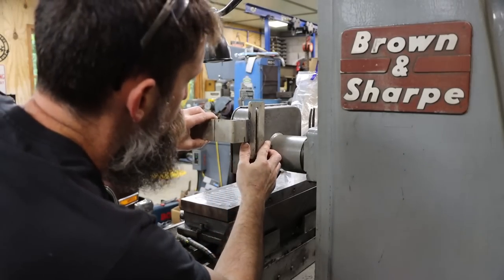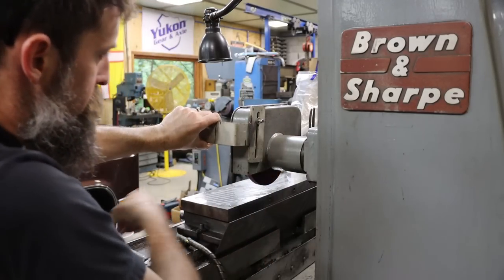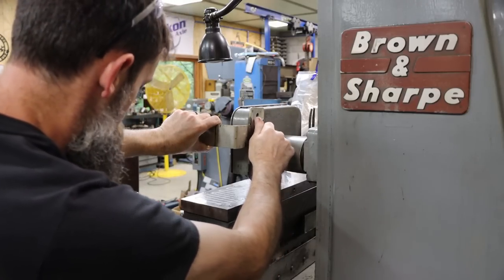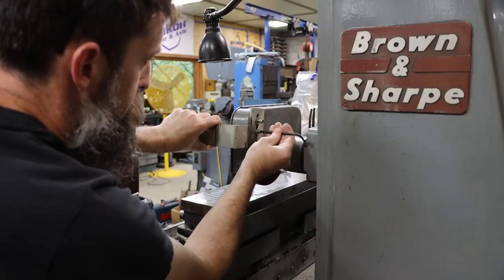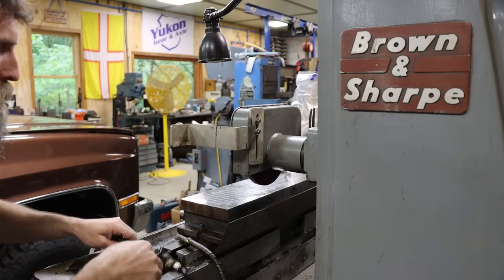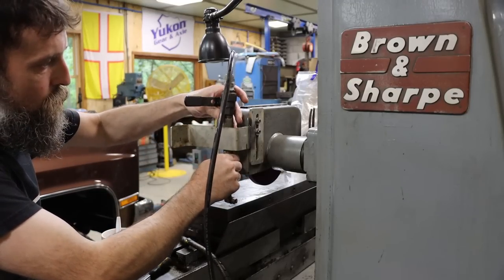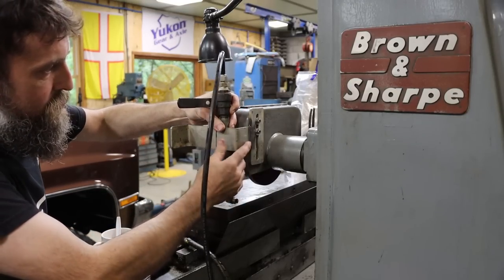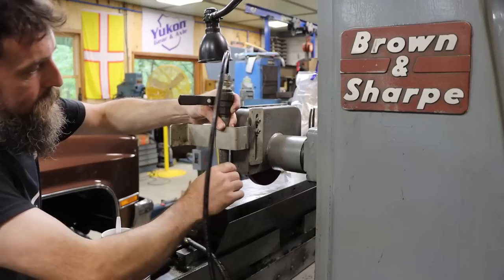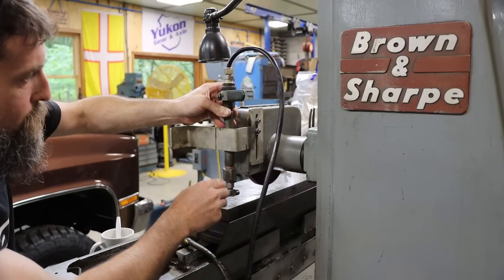So you can see on the back of the wheel guard there, there are two 1/4-20 bolts that are just made into the housing. And I did weld this slotted piece of steel that I already had in my steel cabinet, or just my junk box, to be honest, scrap pieces. Already welded this bracket to it, and now I need to come up with a way to attach, and I may just weld it. I mean, there's no real reason not to, I don't guess, because I got up and down movement in this bracket. As long as I get this centered with the center of the wheel, or pretty close. It ain't got to be perfect. So I've already marked it here.